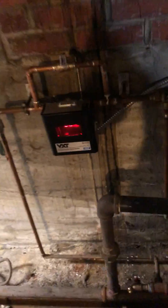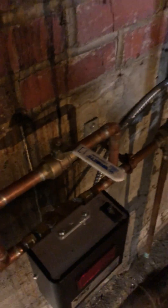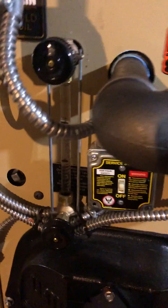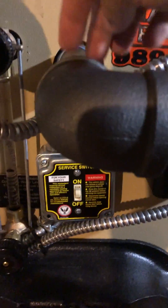What you do is you should have a bypass valve at your water feeder. Very slightly crank that open — that allows the boiler to overfill. And the water will push up the sight glass to the point where you see it get to about the skim port.